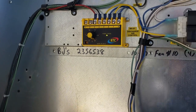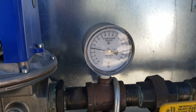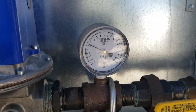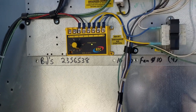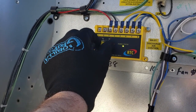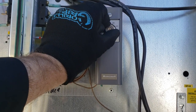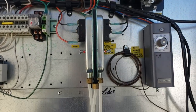I can turn the heat up right there and you can watch it in your pressure - which is your outlet gas pressure - and you're going to see it rise. We typically don't need a lot of heating because we really don't get very cold weather here, so we have this set all the way down to like 55 degree supply air and typically run this at about 45 degrees. We're typically not even going to run this thing right now. You see it shuts off. You also have your cooling section.